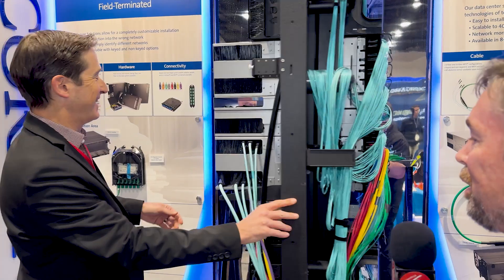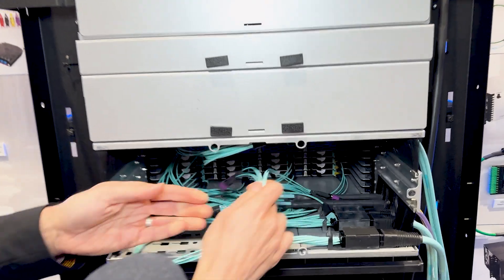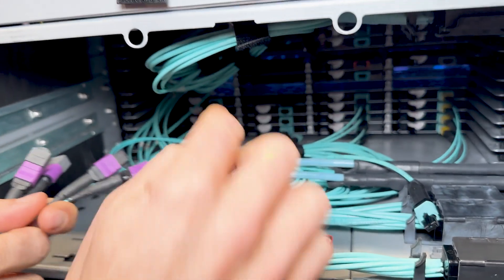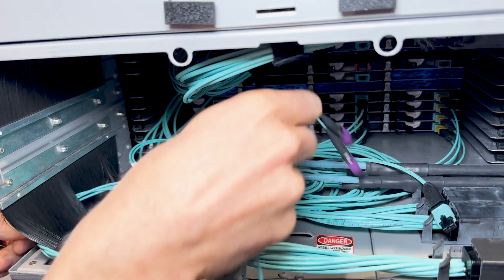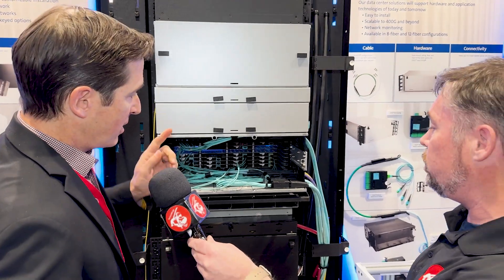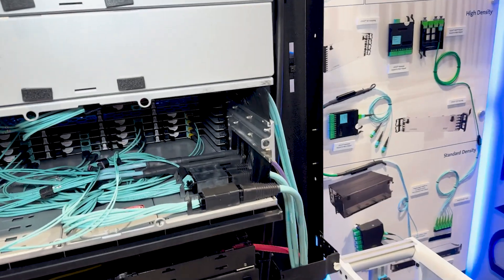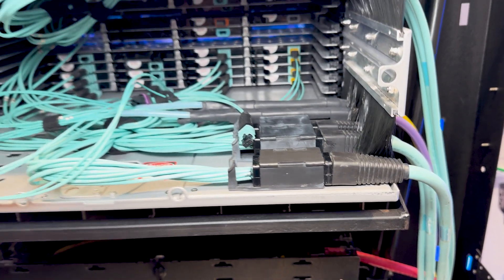As if by magic, we can look at the back of the rack. At the back of the rack, we have what would be trunks — fiber trunks. Here's your MPO or MTP again, which would connect into the back of our panel. That would break out to multiple LCs — 12 fibers, four or six pair. It breaks out on the front to our switches, and then on the far end of this trunk, the trunk would go through your pathways. This is a fiber-to-the-desk setup, so this would get you either to your desk or to your consolidation point in a zone box, which we'll look at in a moment.